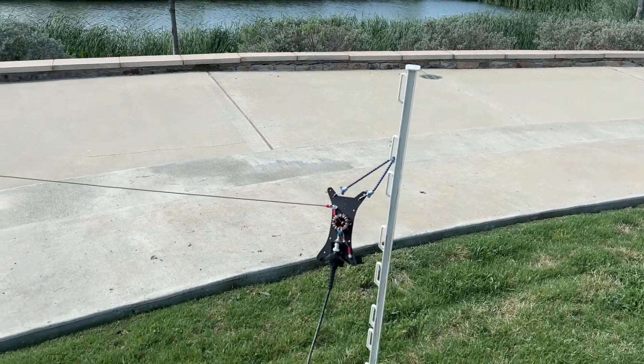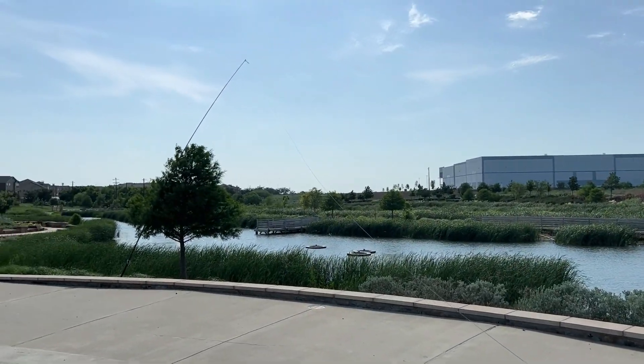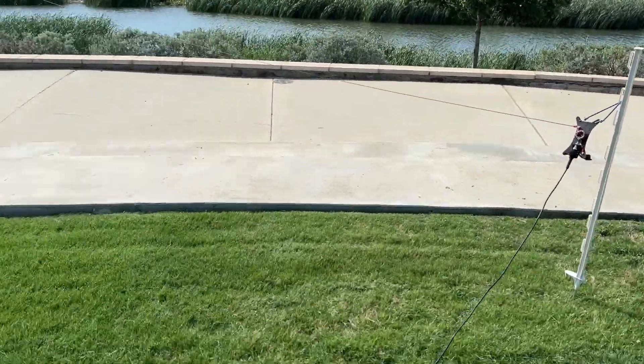So I've got it set up and running. It's a little bit high off the ground. I was moving it around to a couple of different places to see if it made a difference in the SWR. I just got the spider beam leaned up into that tree and the wire's up — it's kind of set up as a sloper. Feed line's running back here, no counterpoise. I was running the Rigexpert Stick 230 on this. I was only able to get it tuned down to 1.2 to 1 SWR initially. I started moving the antenna around, and the location of the antenna actually made a pretty significant difference in the SWR. So I took some screenshots of the SWR reading that came out of the Antscope software.